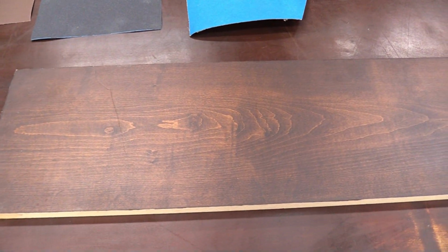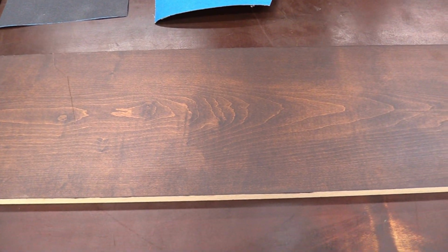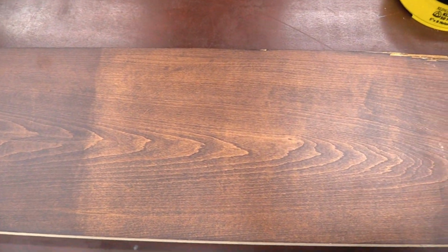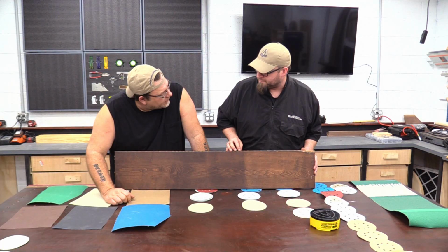After that is when you start to have burnishing again, because you've gone so fine into the 400 that a lot of your high spots, the harder parts of the grain of the wood, aren't taking any stain whatsoever because they're burnished. So they look really light. Yep. And that's because the pigments in the stain had no place to go. And that's why that is.